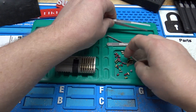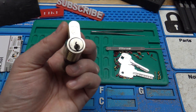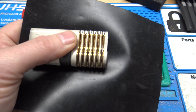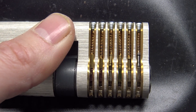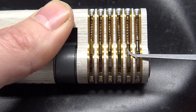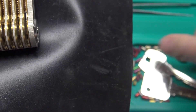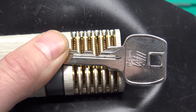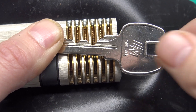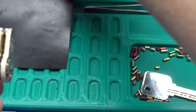One other cool thing I want to do — these cutaways are fun. I've got a Schlage cutaway lock in some of my other videos, but you can actually set these up to practice a false set or practice picking serrated pins. Looking at our pins here: number one is a spool pin, two is a spool pin, three and four are those other security pins, and five and six are standard pins. Looking at the key, there's a very deep cut on cut number one, so that spool pin may not produce a big false set because the key pin is so long.